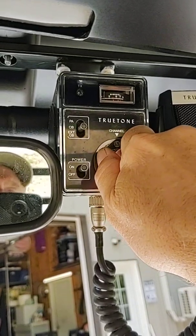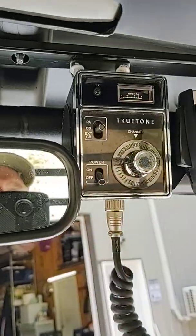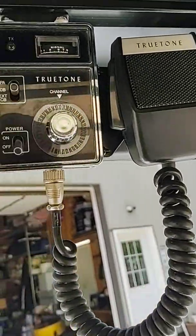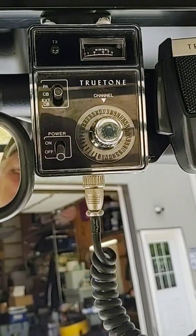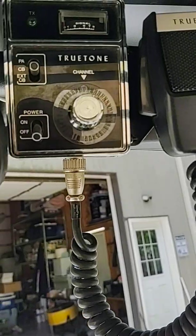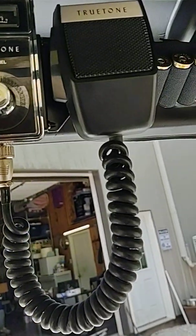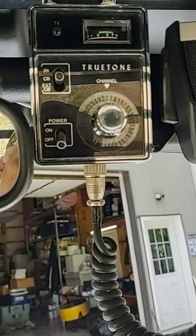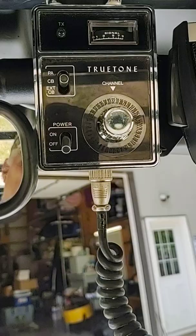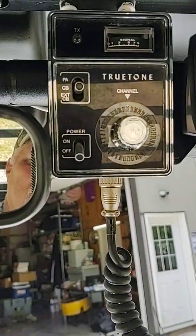So I'm not here to prove to you that the radio works. This is a radio I was going to sell because I wasn't interested in it. I bench tested it. It actually dead keys at about 4. It'll swing to about 12. I have not taken the covers off of it or anything. I figure somebody's probably adjusted it, but this thing is like brand new. Here's another thing. They've added channels to it.